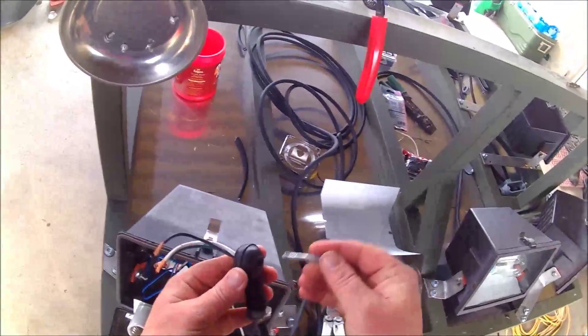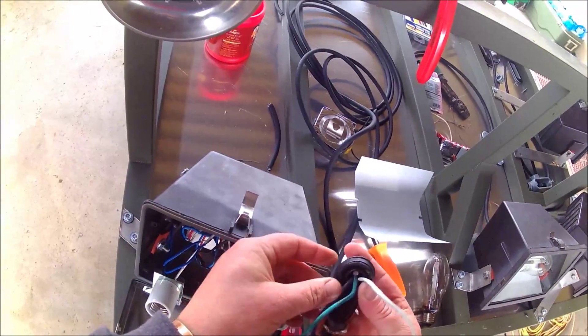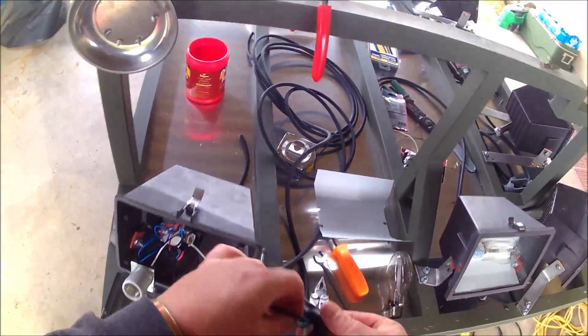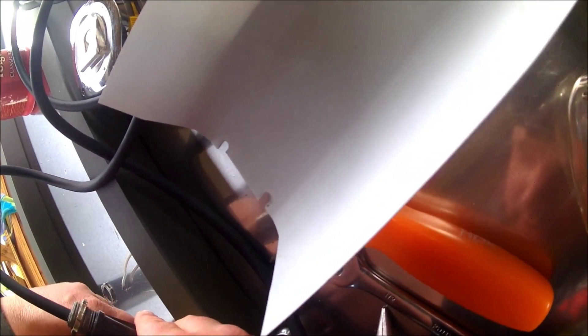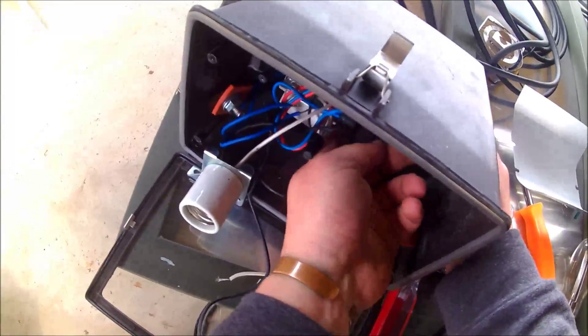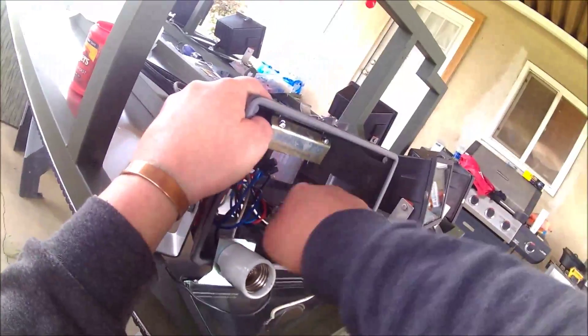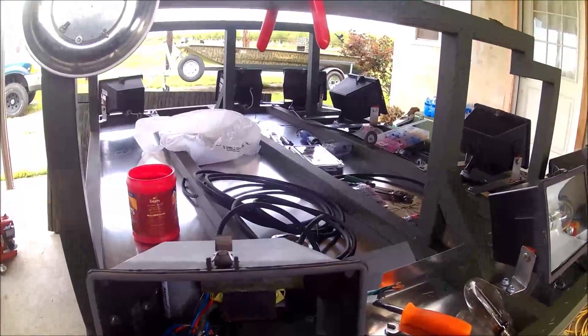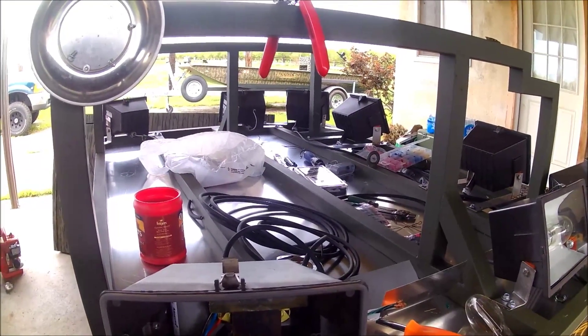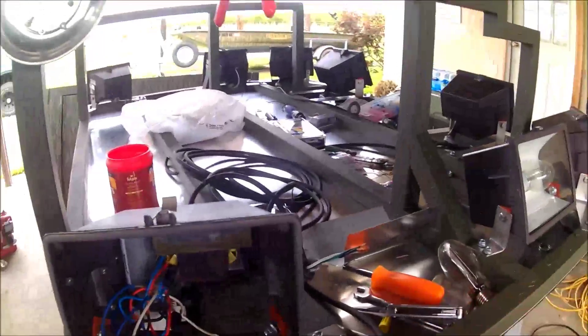Take the bolt that holds this contraption and make sure that you have the wires oriented so that you're not going to pinch them - just like that. Then you need to feed these wires back through this hole. I forgot to remove the existing ground. Do not over tighten anything in here - make it good and snug but no more. It's cast aluminum and if you over tighten it, you're going to ruin it.